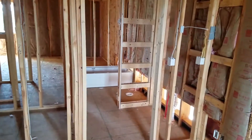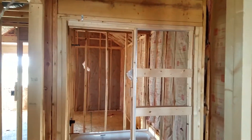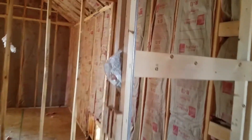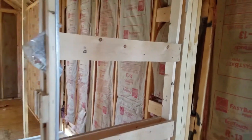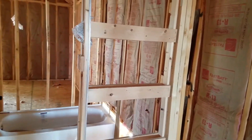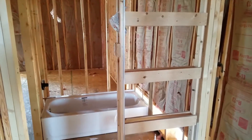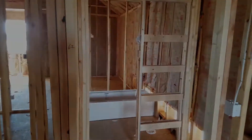There's a pocket door — this floor plan has quite a few of them. That's the actual frame inside the wall that gets drywalled over across those slats, and the pocket door actually slides through here but just gets covered in drywall. People wonder why light switches may be moved around a little bit when there's pocket doors — it's because the pocket door frames take up the wall space and don't allow us to put switches in here. If we had a switch box inside this wall it would hit the door and render it useless. In this plan there's probably four or five pocket doors.